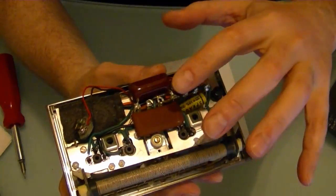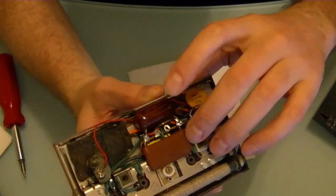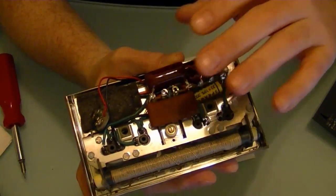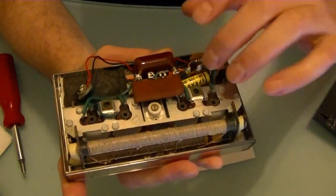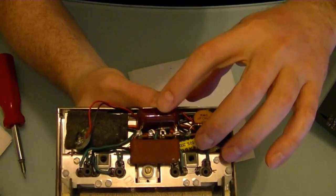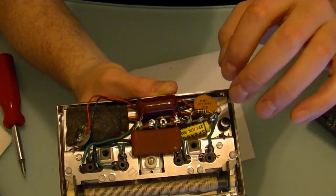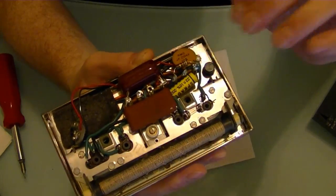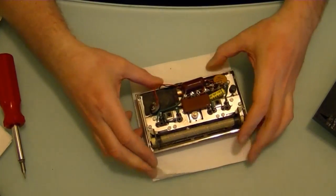Now this runs on very low voltage, even though they have a 200 volt cap in there, so even if this is leaky at say 200 volts, I think there's a pretty decent chance these caps will be fine at lower voltage, especially the ceramic ones. And these will be running so much lower voltage than they're designed to handle. I'm hoping that even if they are a little leaky at their full rated voltage, they'll work fine in this circuit. Okay, let's take a look at the schematic now.